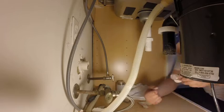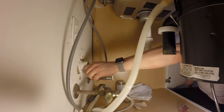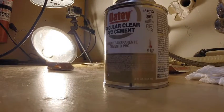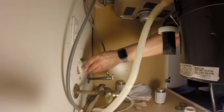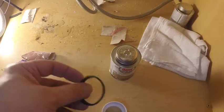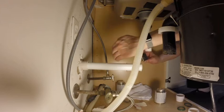Okay. Okay, that's actually pretty sturdy, so I won't need the extension cord. Here we have the trap adapter, so that is going to fit over this. It'll dry fit. And then it comes with two washers. This is for the inch and a quarter, and this is for the inch and a half. Now what we're dealing with on this one is inch and a half. That's not where it's gonna go. It's actually gonna go on that long pipe here that will get us to the P-trap.